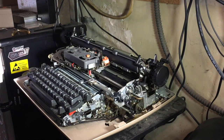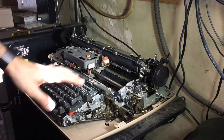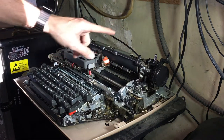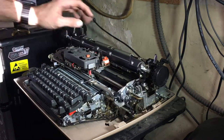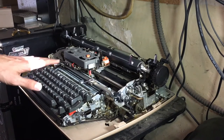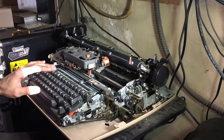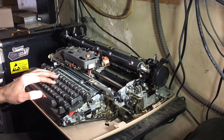The primary issue that I'm having at this time — the machine was working great. Character turn was having an issue, but it looks like it was just the adjustment of a pawl in the back. That's all adjusted at this point. Most recently, I've been getting a little bit more proficient, and I'm getting double-typed characters. The adjustment for that was as simple as — it was actually physically letting me press down multiple keys.